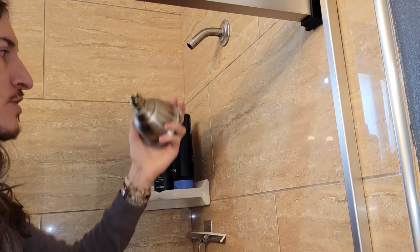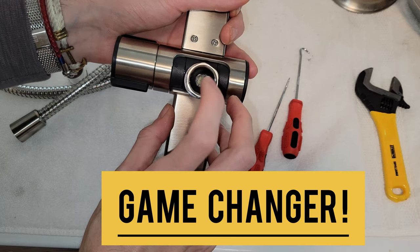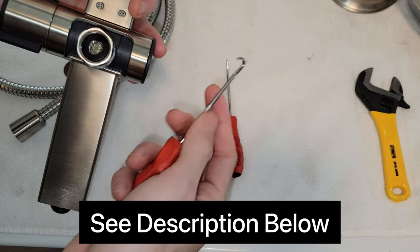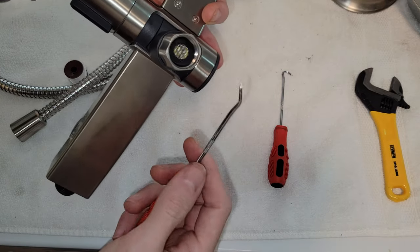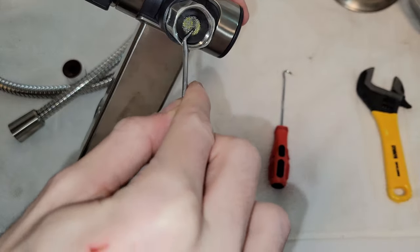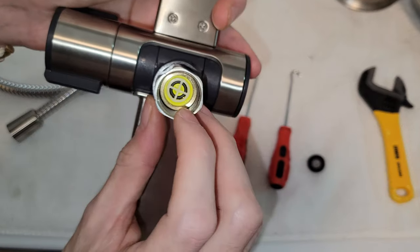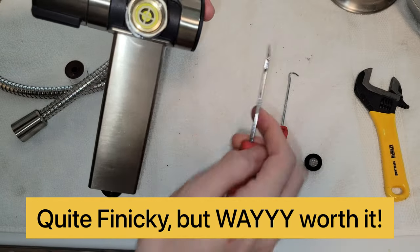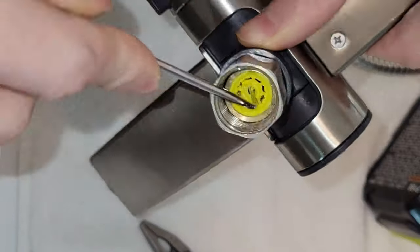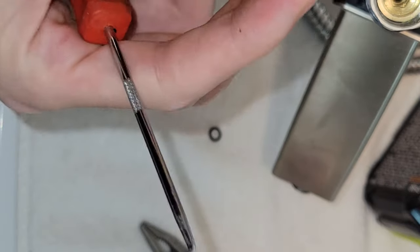It's not a requirement to use plumber's tape — this one has a little gasket inside. Next, we're going to remove the water restrictor. I have these little picks — I can link them in the description, sold on Amazon pretty cheap and quite useful. I'm going to slightly wedge the pick between the screen and lift outward. That screen gives us the frothy water. Then remove the restrictor the same way — just lodge the pick in and pull outward.